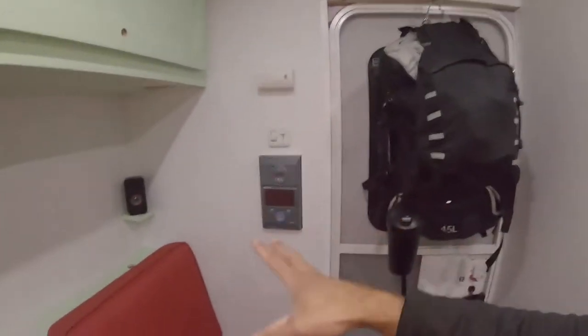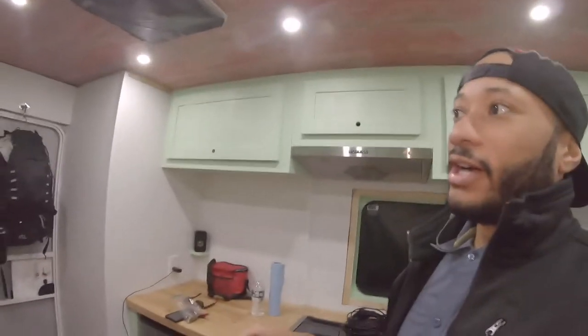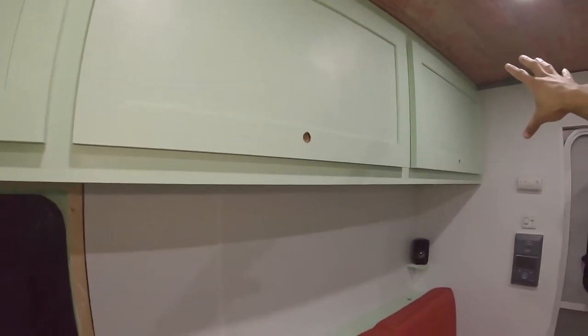I also thought about where to put the holes for the flow of heat. Cool air comes in on this side, travels all the way across all the electronics, and exits down in the corner. The solar charge controller is the hottest thing inside the cabinet, so the cool air comes in and the hot air exits at the far end, away from everything. If I had done it the opposite way, the heat from the solar charge controller would blow over everything else — so just be mindful of your airflow position.